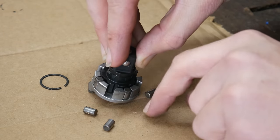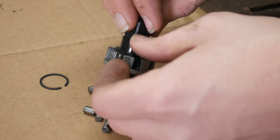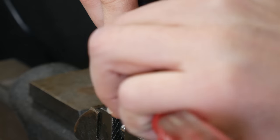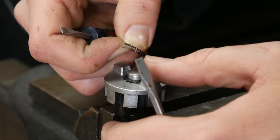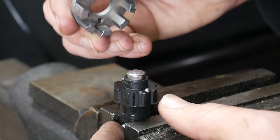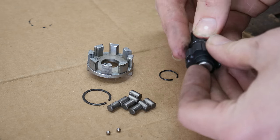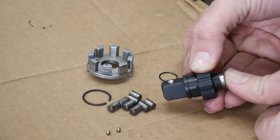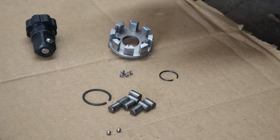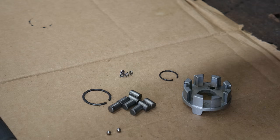This wrench uses a sprag clutch. And since the wrench has to be able to reverse directions, it's not just a one-way sprag — it's actually a selectable clutch. And to separate the switch part of the assembly from the drive head, there's another snap ring we need to remove. This one is smaller and a little tricky to get to; we're basically just going to force it off with two flat blade screwdrivers and then pry it off around the perimeter. And pretty soon the ring has been removed and the assembly can be taken apart. Once we lift up the switch part, we can see how the detent works — it uses two little spring-loaded ball bearings. It doesn't seem like the button wants to come out of the drive head; I think the detent ball is press fit in there. It seems like there are only four pieces in that assembly: the detent ball itself, the button, the drive housing, and the spring. So in total, including the eight rollers, there are 20 pieces in this wrench. For this assembly, the drive head would be the inner race, the switch would be the cage, the rollers would be the sprags, and the outer race would be the body of the ratchet itself.